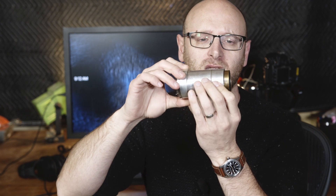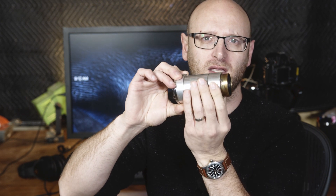There are a couple of tubes that are sort of pressed into each other, but the tricky part was making this element here that turned a rotation into a linear motion. So that required making a one thread per inch groove, and being sort of an absolute novice, I thought, well, that's easy — you just get a lathe. So I bought myself a cheap Harbor Freight lathe. I like to buy cheap tools when I'm beginning a hobby because I'm never sure whether I'm actually going to stick with it. So I bought a cheap lathe and said that's the right tool for cutting a thread, and I was wrong.